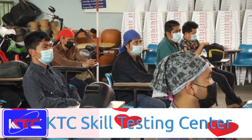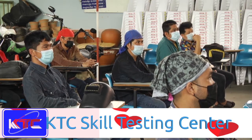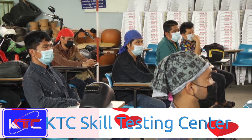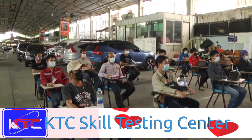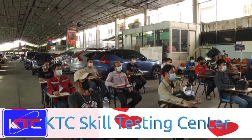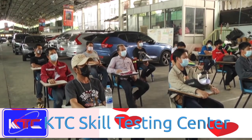So there are three steps to the welding test today: first the root pass, then the hot pass, then the capping. After finishing, every welder owns their test piece and a photo is taken as evidence of their work. The consumable used is ER 2209 duplex welding rod.